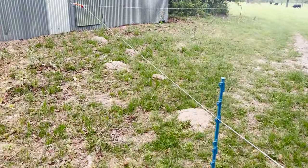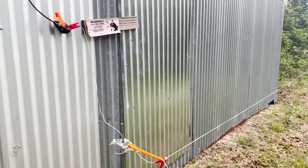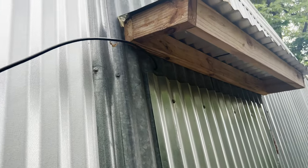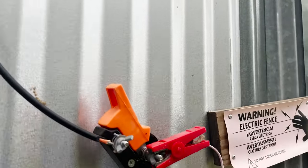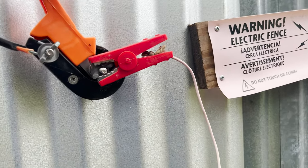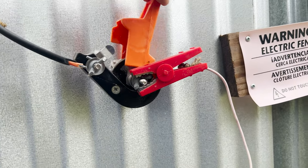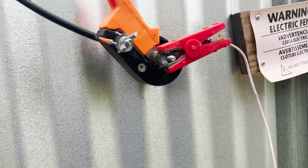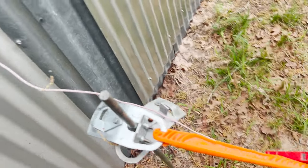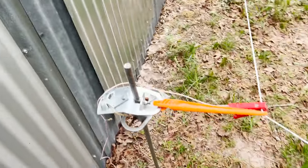I put this post where it can push the wire around that tree. My electric fencer is inside this little barn, and I've got it set up where the hot wire comes out through a hole right above the door. Then I hooked it up to a cutoff handle — a thing to cut your fence off when you're going through — and my jump wire goes from that to the electric fence. I'm going to disconnect that so I don't get shocked.